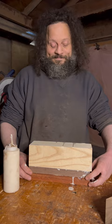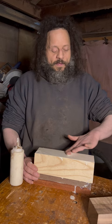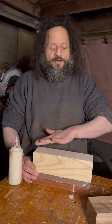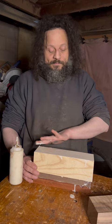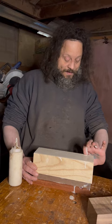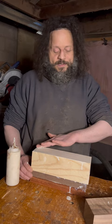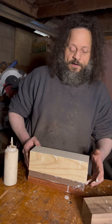It's hard to describe how much glue to put on, because the barrier between too much and not enough is so slim. Your woodworking ancestors speak to you and tell you when to stop, right? Yeah, pretty much — that's about how it goes. You have to put enough on so that it soaks into both pieces of wood, but if you put too much on you get these ridges that come out even after it's dry.